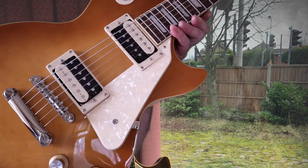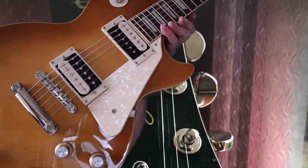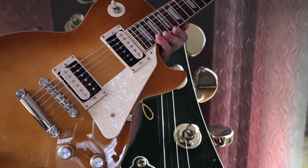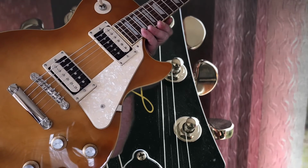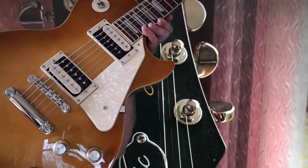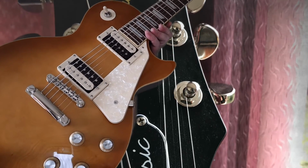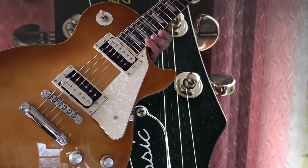You've got the zebra, you know, black and cream bobbins for the pickups. These are Alnico Classics, and they are popping out exactly what I'd expect to see from Gibson 57 Classics. They're popping out late 7s, which is very healthy, and it's a sweet spot for pickups, to be absolutely fair.